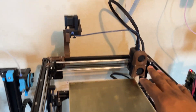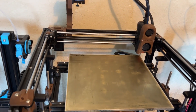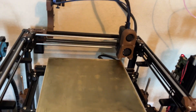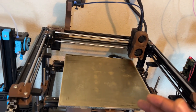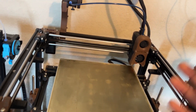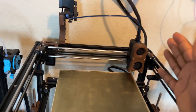This is still running good. I had to shorten the Bowden tube — it was way too long — and mount the extruder up top. The problem was the Bowden tube was so long on the Legacy that it was pointless to run any pressure advance; there was no difference. Shortening it made pressure advance a thing again, and also allowed me to print PETG, because with the Bowden tube so long PETG just wasn't having it. Moving the extruder from the side to the top made it print ten times better than before.